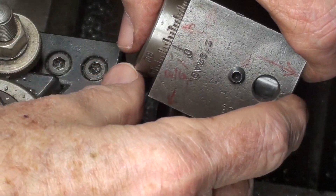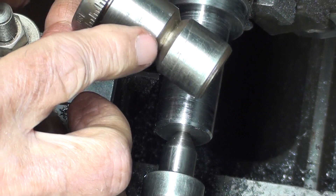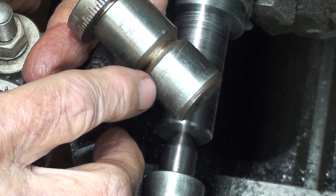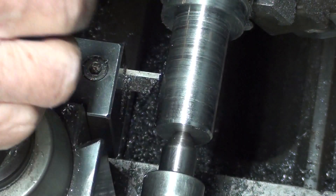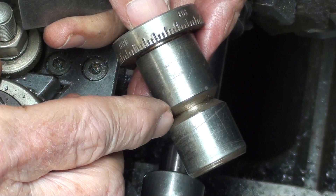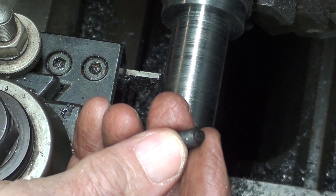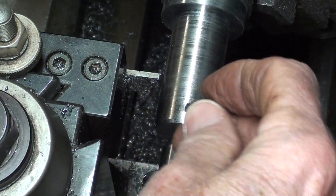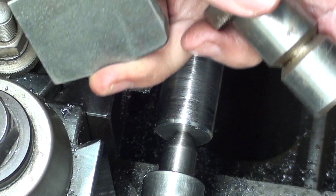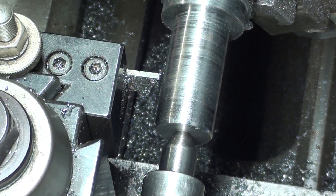Next I'm going to square off this shoulder just a little bit and undercut it using the cutoff tool. I need to turn down the major diameter there so that it is the same — I got 1.38 on there but I'm going to make it 1.356. We're still not done. The next thing I want to do is put this groove in the sleeve. They put a V groove on the original, but that causes chatter, so I'm just going to make a flat groove with a cutoff tool. The distance is exactly 1 inch from the flange to the center of the groove. I'm going to use a dog point screw — a fine one simply because that's what I've got. Let's cut.